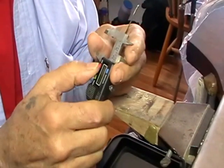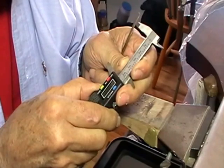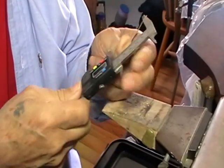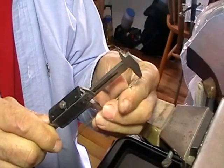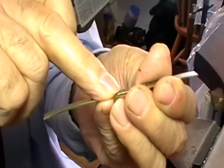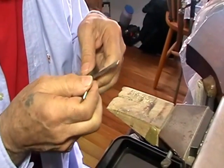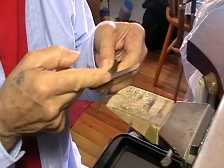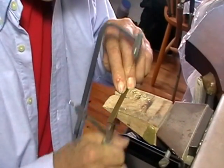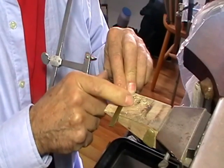My measurement is 55. The easy way to mark your metal is to just take your digital calipers — vernier if you don't have digital. Set your size, tighten the little screw, and you can just hang your verniers on top of the metal and sweep the bottom across. It'll give you a nice little line to cut to. You can use your tri-square to make sure that the line is square. Scribe it and saw this mark — saw just to the outside. Make sure when the saw goes through the metal, it goes into the wood and not into your finger.